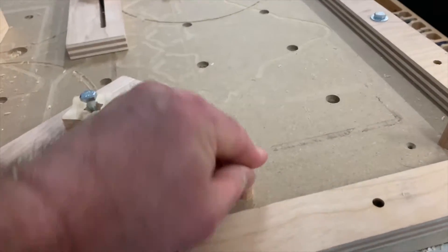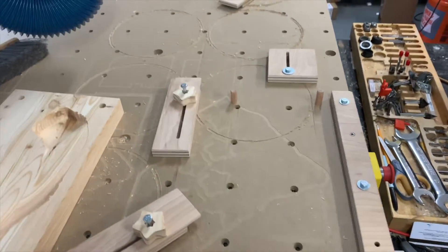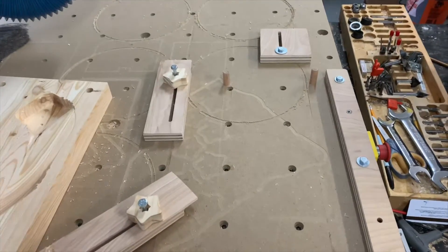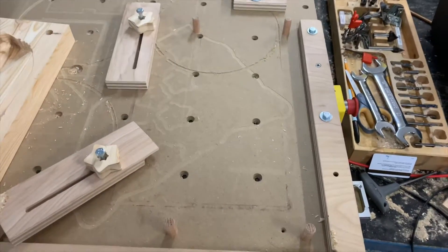This right here shows the dowels — they're located in holes in the table here, here, there, and there. Another thing these provide is they take up the shear that you're getting from the machine while roughing through the material, so that the stock doesn't start rocking around and give you mechanical deviations. It helps to keep the part located.